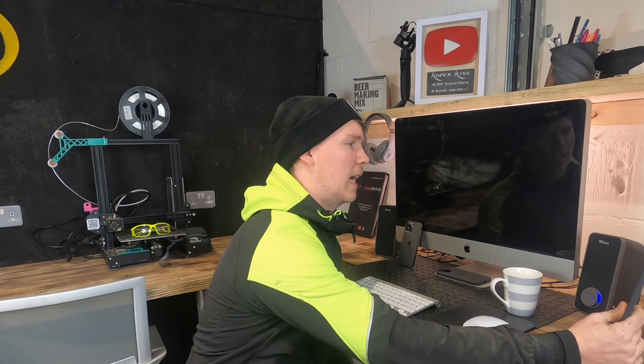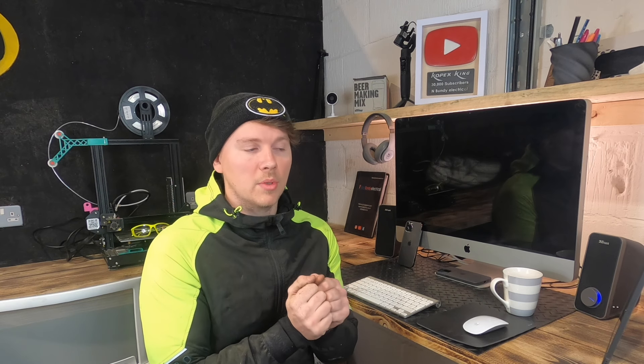We went around and tested. They had metal sockets and metal switches dotted around randomly, metal light fittings in the kitchen, bathroom, all that sort of stuff. As Adam got the first test out, we did our R1s and R2s and it was non-existent. It was wired in singles, and we had a retrofitted earth afterwards - by the looks of it a 2.5mm earth, singles earth, single-insulated.